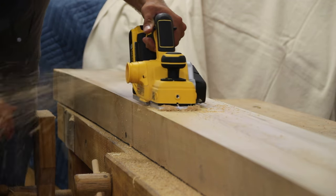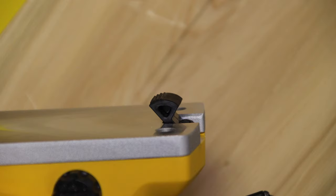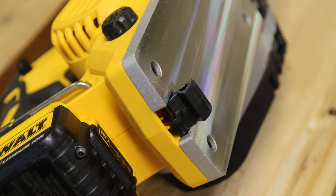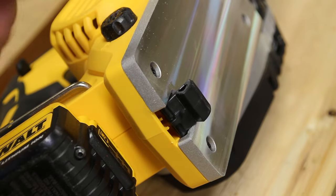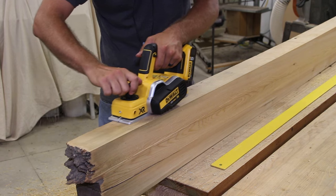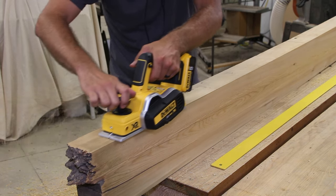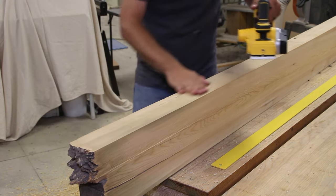On the bottom rear of the unit is a hook or tool rest. When you set the planer down it props up the flat bottom so it will not cut into your workpiece, workbench, or whatever you set the tool on — I think that's really ingenious. It can also lock out of the way if you don't want it. When starting in the middle of a board to take out a twist or cup, I lock it away, push the front of the planer down, and rock it forward to slowly make contact with the blade.